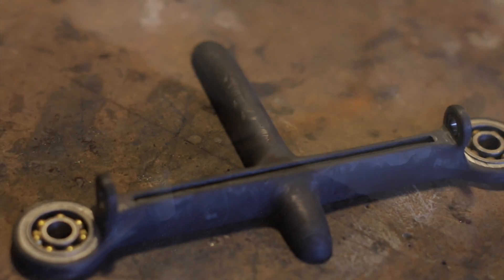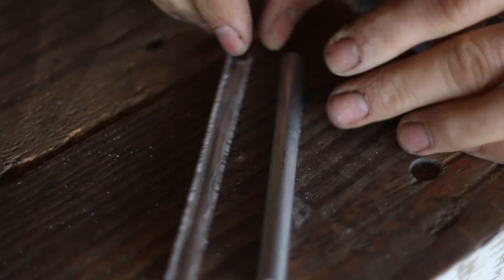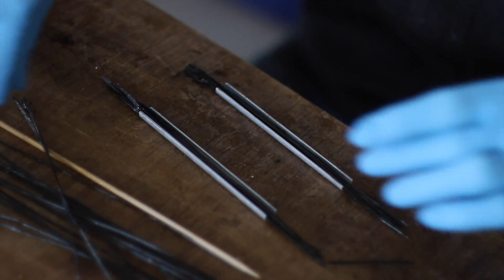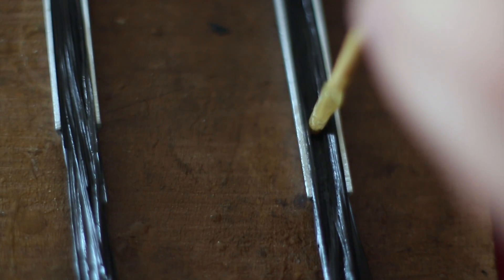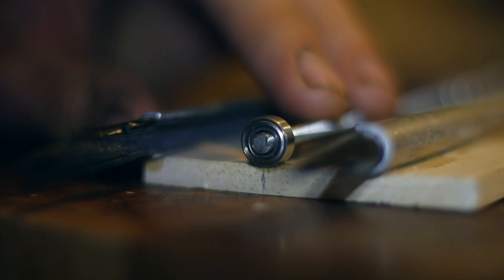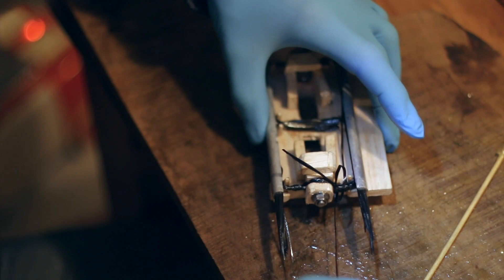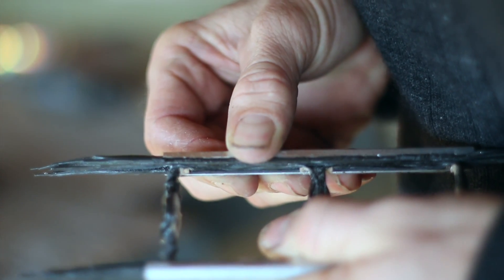I really wanted a solid camera platform adjustable on both X and Y axes. I decided on round rails, and that way I could wrap carbon around them to form a platform that could slide backwards and forwards via a thread and rod. I made this part in reverse — I made a balsa wood exoskeleton and constructed the carbon platform from within. I'm actually quite amazed it worked, as I needed to be sure that every single measurement was precise.